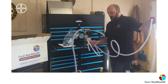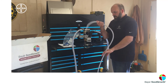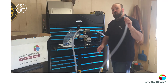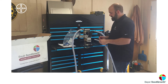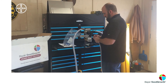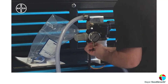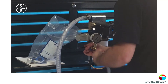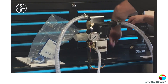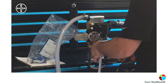So this is your 3/8 hose. Very important not to cut or tamper with this — this is what all your charts are based off of. If you shorten it or you put a longer chunk of hose on, then those charts are no longer as accurate. Your hose clamp is in here. I'm using a nut driver — you're more than welcome to use a flat blade screwdriver, it'll work just fine.